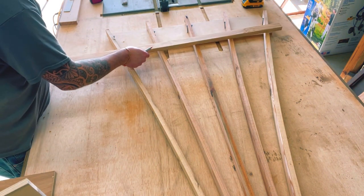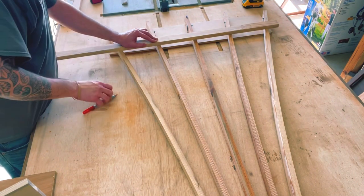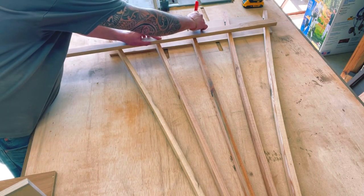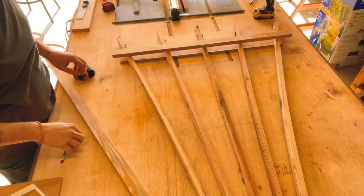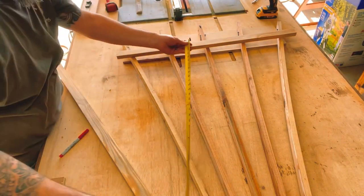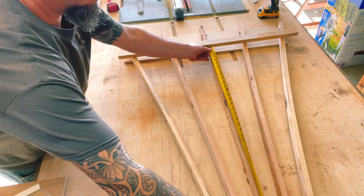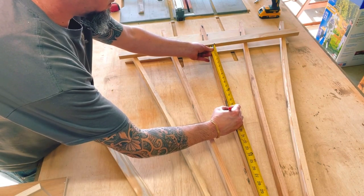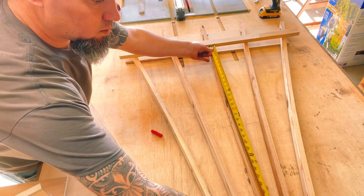The amount of overhang you leave is up to you. I decided to put a couple of inches of overhang, and I'm marking here where I thought it looked best from the top. This board is cut at 42 inches — that allows a couple of inches of overhang based on where I decided to place it, and that is marked on the center board. Now I'm going down and figuring out what spacing my next two boards would look best at — for me, that would be about 16 inches.